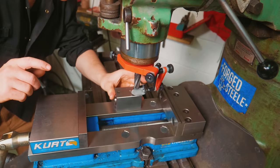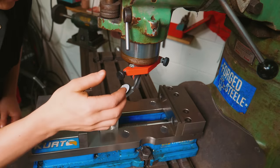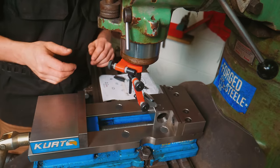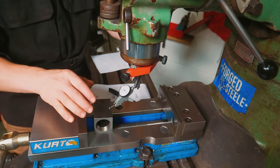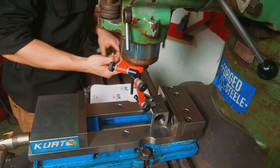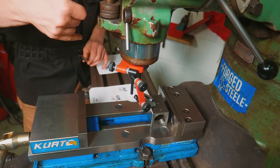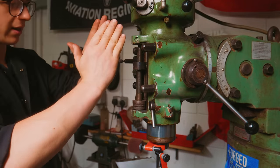I'll put the collet block back on — we're now at 10, 14, 20... I bumped it, start again. 100, 90 up, we'll call it 105. 95, 100. This is a tenth indicator. The biggest outlier is in this direction and it is tilted this way, so what I need to do is tilt it back the other way.